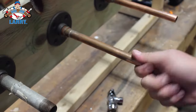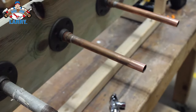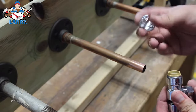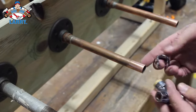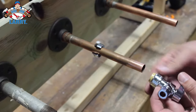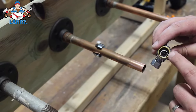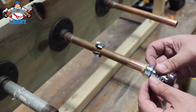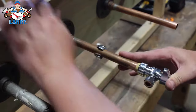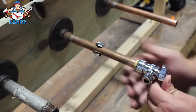Fairly simple. So we're going to grab the SharkBite. There's a little trim ring on there that we're going to take off. We're going to slide that on the pipe first. Then, putting the valve on is actually fairly simple. You're going to see that plastic piece there — it just needs to go inside the pipe, and then it just pushes right on.